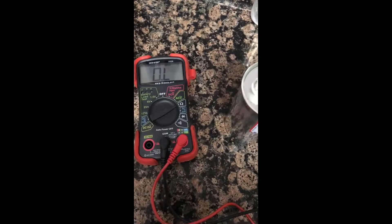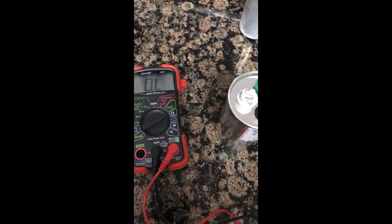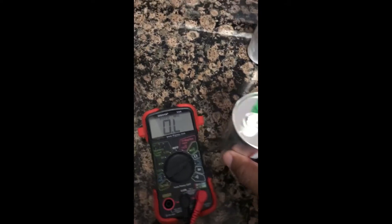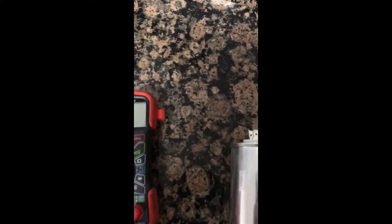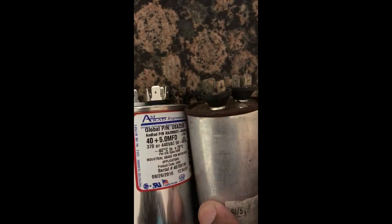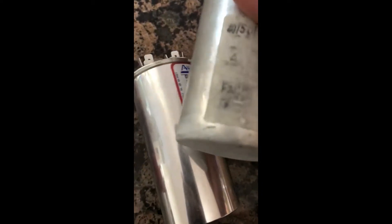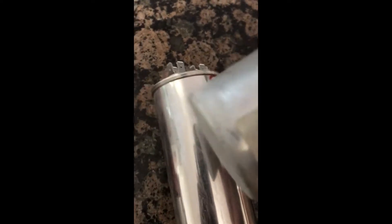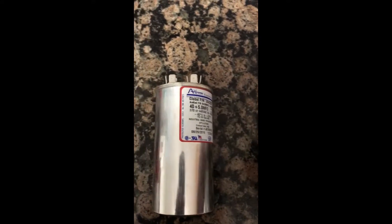That's how you can tell if your AC fan outside isn't turning or your compressor isn't kicking on — your capacitor more than likely is bad. And you can see the difference: you can see how this one is bulged up. See how this one is just laid flat. You can see how it's bulged at the bottom — look at it, you can see it bubble up, got a round bottom versus this one which has a flat bottom.